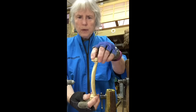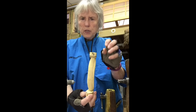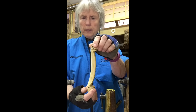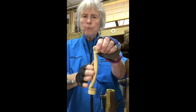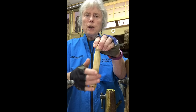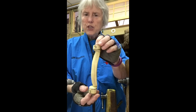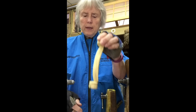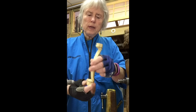Well, this is just one example of the first quadrant that I mentioned, which is parallel axes and arc type, meaning that you don't go all the way to the solid wood, but you create profiles, and as each profile intersects with each axis, it becomes arcs that intersect. Here's one example. That's a bead on one axis and a cove on the other.